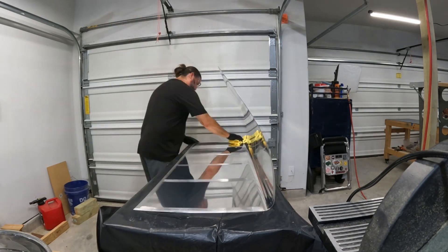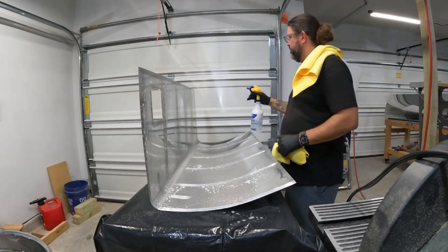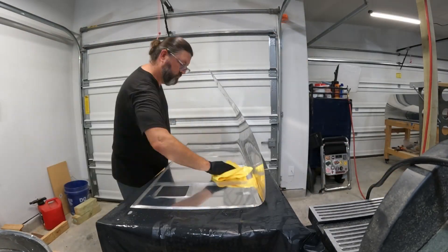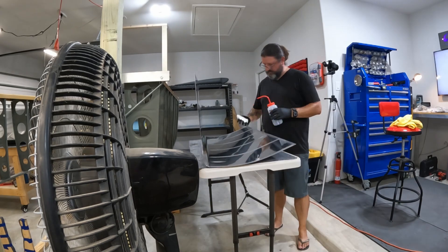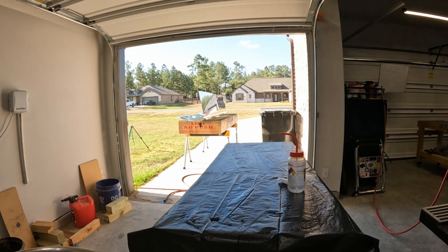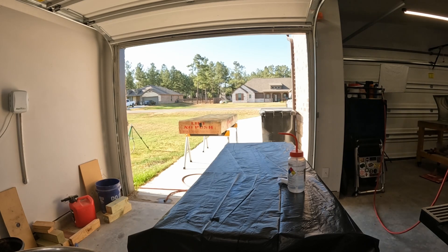These skins and ribs I'm working on today also have to be dimpled, because we want the plane smooth and fast. Mechanically it doesn't look like a lot of work — just put together and rivet — it's straightforward without all the little odds and ends like the tanks. But there are a lot of tedious but absolutely necessary operations, so it'll still take a good amount of time. When it's done, the leading edges will be permanently affixed, the top skins will be permanently affixed, and the fuel tanks will be temporarily installed just to keep everything square — then they'll come off for leak repairs. That's it for today; we'll work on the ribs. Thanks for being here.